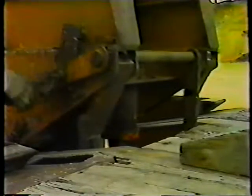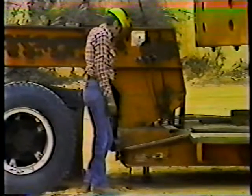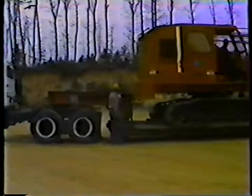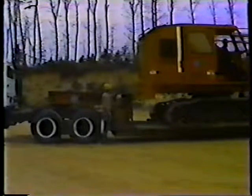Start the trailer motor and push the hydraulic valve down. When the trailer is fully raised, engage the safety latch for the gooseneck and the two stabilizer bars. Then connect the electrical cable and the air hoses to the tractor. Then raise the hydraulic ram. When the trailer is hooked up, drive the crane back until it almost touches the gooseneck. Now the machine is properly positioned for towing.